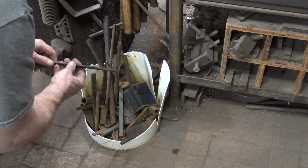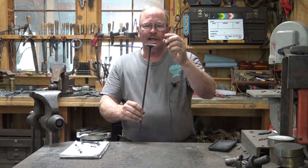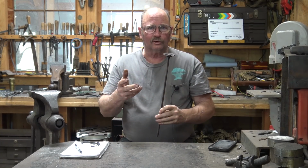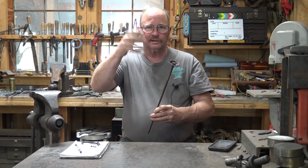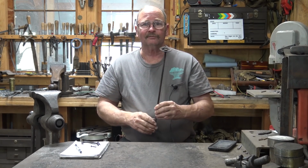And what I envision making out of this is some kind of a ceiling hook using this big washer as a flange to mount it to the ceiling, and ideally the bolt head will then provide a pivot point inside that if for some reason you want to turn the hook. It's not going to be some sort of a ball bearing pivot, so you can just reposition it and hang a plant on it if it matters which direction the plant turns, but you're not going to be able to spin anything on it. It's not that kind of a pivot.